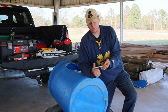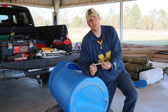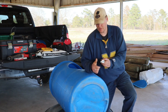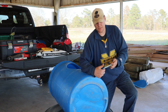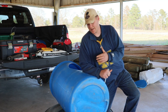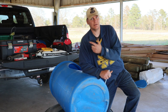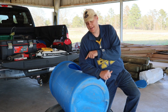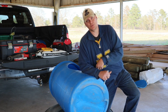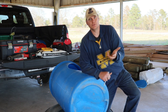These are the bolts — half-inch carriage bolts. I've got a washer on one end and I'm going to put a washer on the other end. They're going to sandwich right up against the inside poking outward. My wife asked this question, and I'm sure a lot of you might have the same thought: how do you put all four of these in and still get it inside if the goal is that it can't come out? So what we're going to do is put two of them in — the hard-to-reach ones, the back one and one side. Then after we get it in with those two, it'll slide, and I'll reach through the hole to put the other two in.